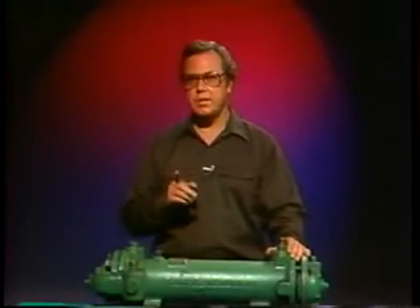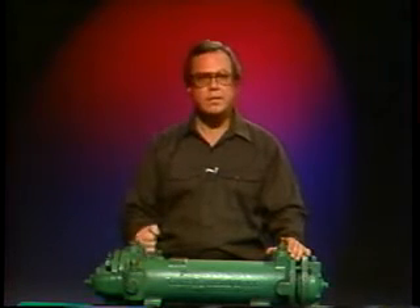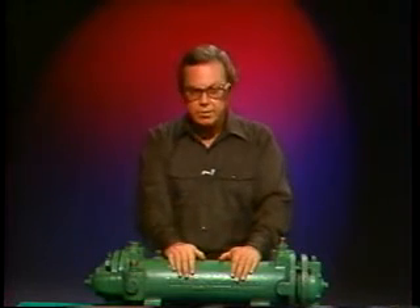After the other header's back on and everything's tight, a final external cleaning with a rag is just plain good practice. The last step before they put the cooler back in the storeroom is to check and make sure there are no leaks. One way to do this is to hook up the tube side inlet to the usual cooling water system and plug the outlet. When the valve is open to allow water to flow, there should be no evidence of leakage either at the gaskets or into the shell from the tube bundle.